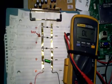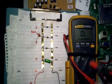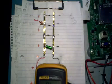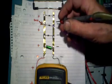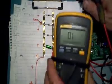In the old days, what we'd do to find a short like that is start unsoldering one component at a time until the short went away — that was how we'd isolate the problem. That's really a primitive way to do it, because there are much better ways rather than having to unsolder individual components. One way is to have a highly sensitive resistance meter.